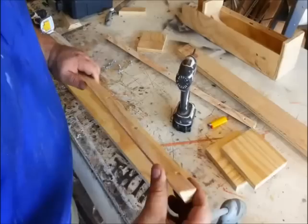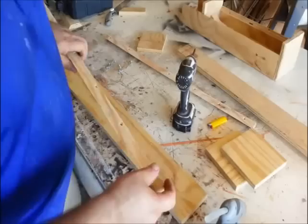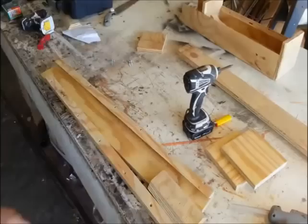To start the assembly, I've taken one of the smaller pieces with the angle on it and I've pre-drilled some holes in it. The holes are drilled so when they come through, they'll come through this piece right here and not into that miter cut. And I'm just going to dab a little hot glue on here to hold this thing in place while I screw it on.